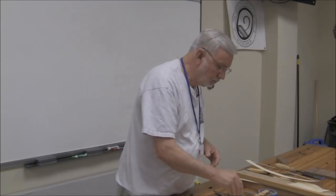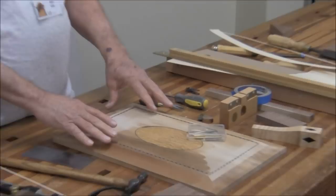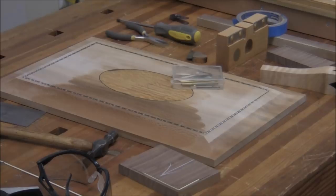Question: How do you prepare the substrate for stringing? When you're ready to do your banding, stringing, or inlay, you have to prepare the surface for the finish. In my case, normally I do it with a hand plane. I'll hand plane the surface and now I've got it prepared for my finish. Then I'll start doing my stringing and banding or inlay or whatever it is I'm doing.